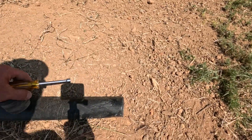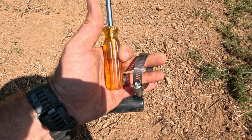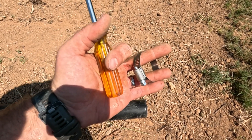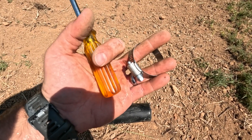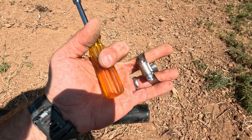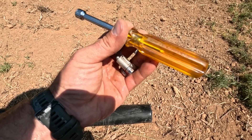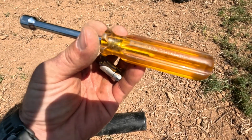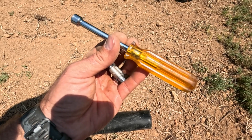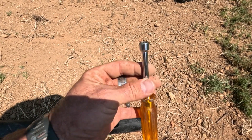Don't use an impact driver — like a DeWalt impact — for these little Ideal worm gear clamps, because it will strip them out. It might not strip every one every time, just enough of them to make you mad, and they're expensive. Do yourself a favor: I bought these off Amazon — actually made in the USA — they're about six dollars a piece. You can really put some torque on these worm gear clamps with a 5/16 nut driver.